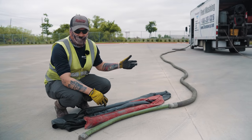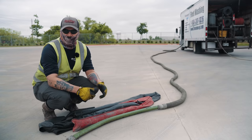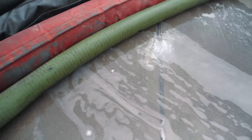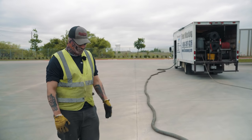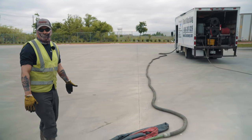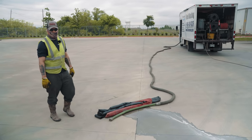It's always good to have an extra filter in your truck — if it gets clogged up, uncap it, put a new clean one in, re-screw the cap, and it'll start working properly again. As you can see, we got a pretty good flow of water coming down here; the sandbags, the black rubber mat, and the vacuum are all working. It's been recapturing water for about 10-15 minutes and we've got no water going past, so the vacuum's pretty much doing its job.